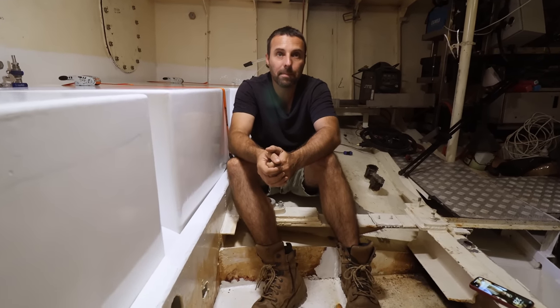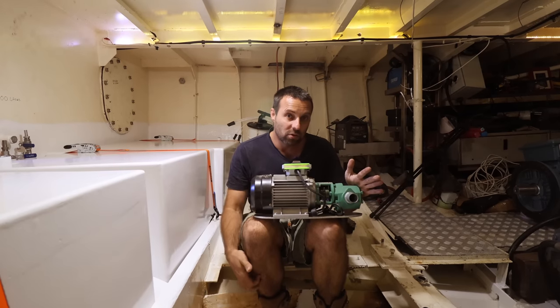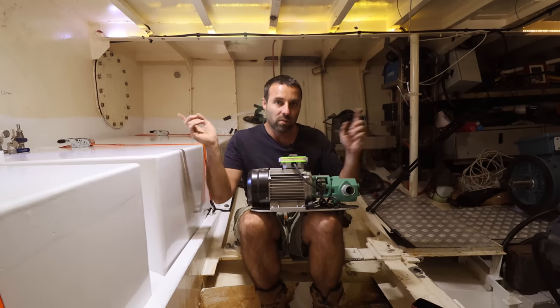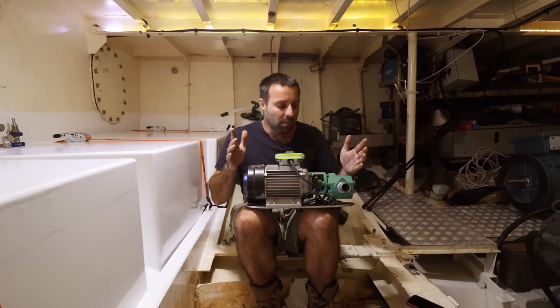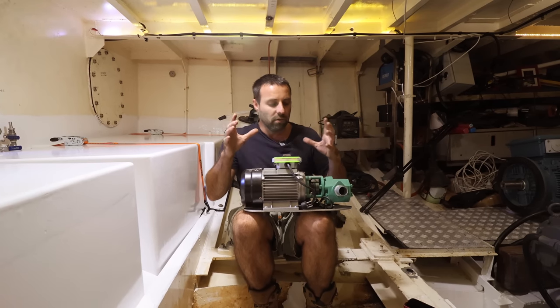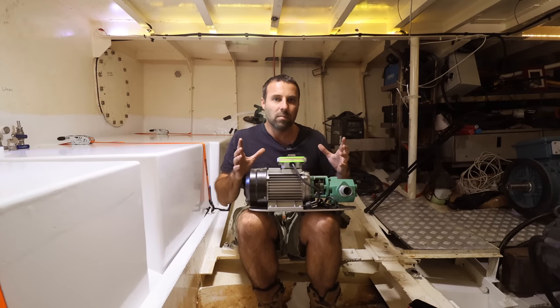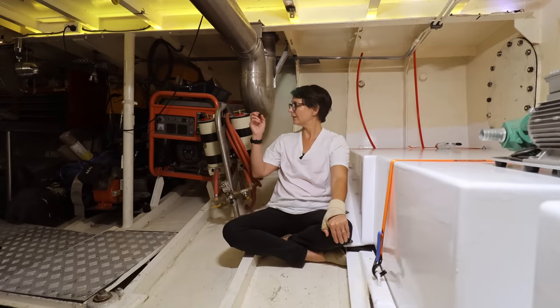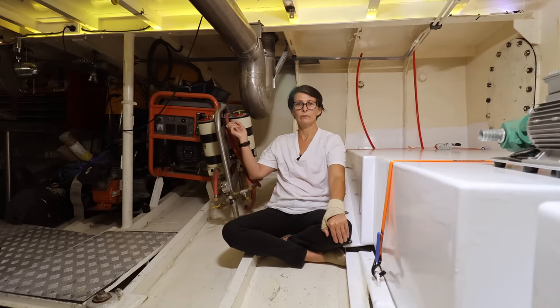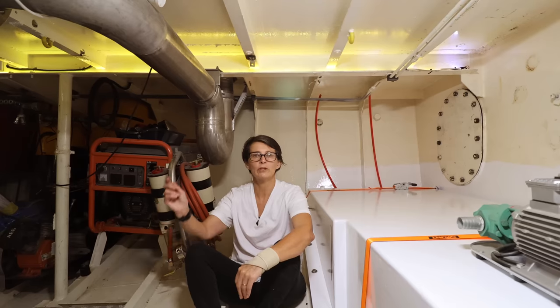And when you say a big pump, can you show me how big you mean? So this is our main fuel transfer pump. This is high volume transfer between tanks. It's not an engine feed pump. This is something that needs to be mounted with the fuel filters, ball valves, manifolds, all that sort of thing. We've got a few ideas as to where we want to put this stuff, but we haven't locked anything in because we don't really know. So wherever these get located, we've got to run them from the access to the diesel at the back through these filters to the injection pump.